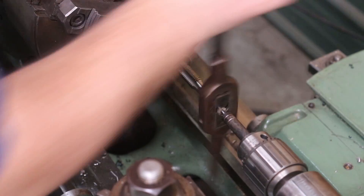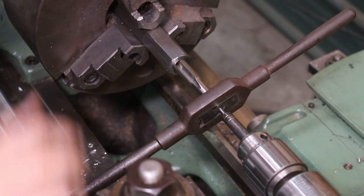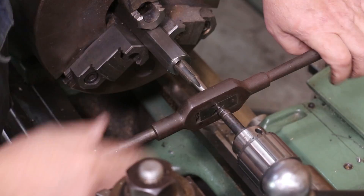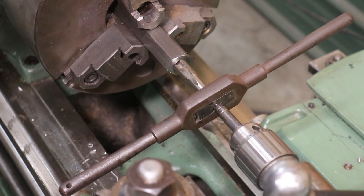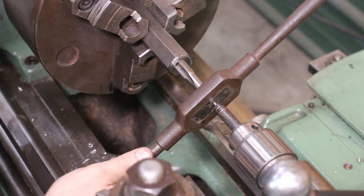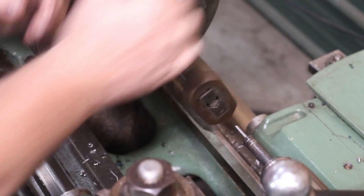I'll turn this in and go down to the bottom where it bottoms out. I might have to put this in a different gear so it doesn't spin on the machine — that should hold it. As I go down with that tap follower I'll just tighten it up by moving my quill in to make sure it stays engaged. And I think we're at the bottom there. Pull that tap follower out of the way and we'll come right out.